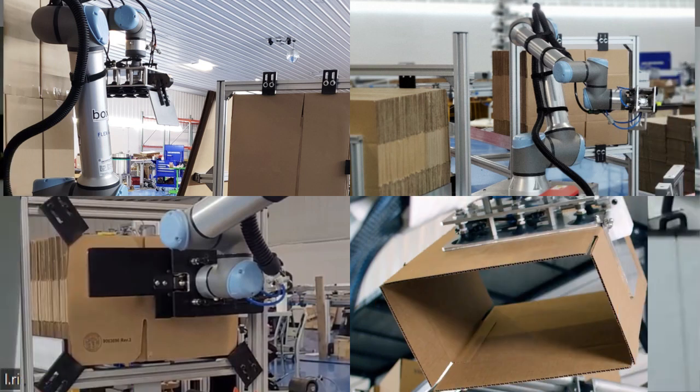But what are the operating costs? Since we use a collaborative robot, that's actually just 120V in and an airline drop. All of our end-of-arm tooling for this is vacuum-generated, so we do need compressed air — but most plants have that capacity anyway. It can just plug into a standard wall outlet, which is really nice if you have more than one location you want to put it in. We can design it so it's on casters and you can roll it around to different parts of your plant. And since it's a collaborative robot, it doesn't require the guarding that you would need with a traditional industrial robot.